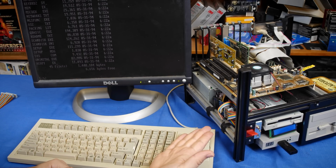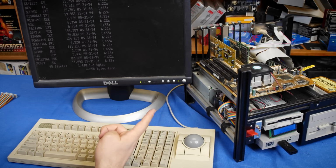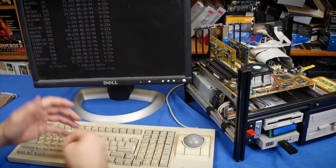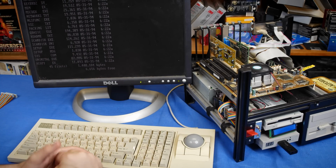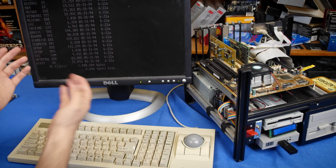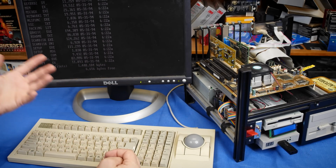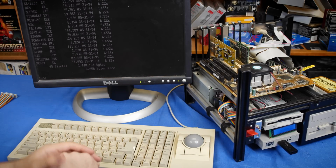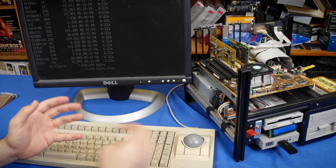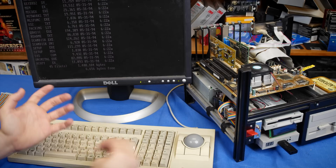Unfortunately, it's not included in Windows 95 and 98, and definitely not the NT Windows. And the driver.sys is locked to the exact kernel version of DOS that you're running. It's not compatible with, say, an older version. I can't get the driver.sys from 622 to run on the 7.1 from Windows 98. I haven't been able to get it to work on FreeDOS at all, which does not have an equivalent. So if you want to use something like this, you're kind of locked into the specific versions of DOS that include it. But it's pretty awesome that it works at all.